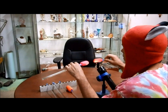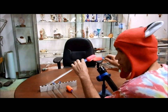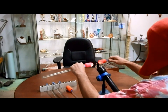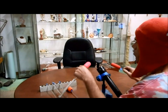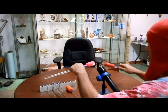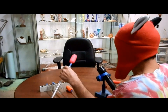And the same thing applies with tube or rod. With tube, it's a little more delicate because you want to make sure the wall thickness is the same, so you have to prepare your seals well. And with rod, what's important is, you can go from small to big on rod fairly easy. You just have to follow the first step I mentioned earlier about basically transferring that heat from the seal back up into the thick spot rather than the thin, because it'll drift off on you because of the heat.